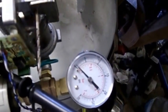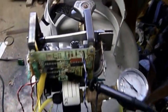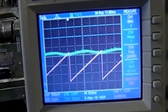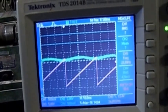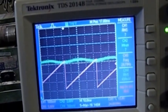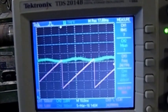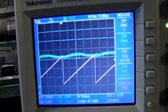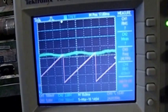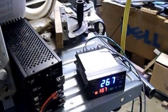The pressure is hard to see here but it's about half a PSI. This is a modulating controller, and if we look at the oscilloscope, that triangle waveform near the center is just the pulse frequency of the controller. The sinusoid in the center is actually the gas pressure. The controller puts a bit of modulation on the pressure, and that enables me to go down to very low pressures across a very wide range of control - from 100°C all the way up to 2550°F, which is near 1400°C.